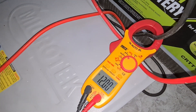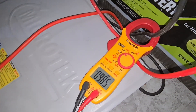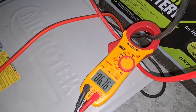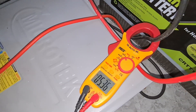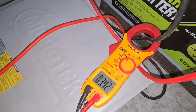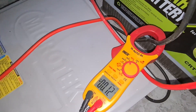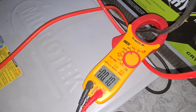The lead acid charging profile is different from lithium iron phosphate cells. There are existing inverters that come with a lithium ion voltage profile configuration, and I would recommend buying those if you're new to this. Since many of you were asking what happens when you connect lithium iron to an existing inverter, I'm doing this test — but I'm not recommending it, just showing what happens.